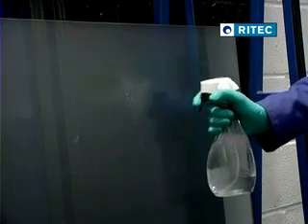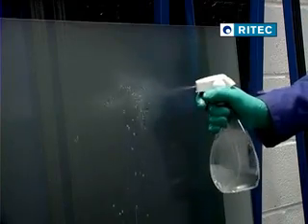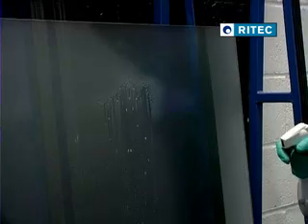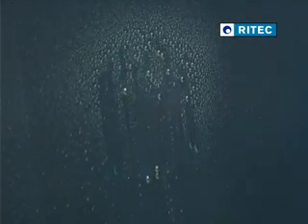Failing to make these observations could be due to improper preparation of the glass surface, or to the premature removal of the excess polymer before curing is complete. The reapplication of ClearShield Sandblast Protect is in this case necessary.